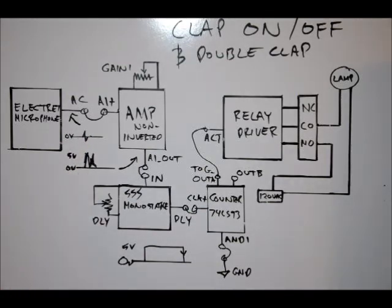However, when we clap, we get a frequency — on, off, on, off repeatedly — and we only want one pulse. You get a big whack of messiness; it's five volts but it's really a whole bunch of spikes, because every single tone has its own different frequency and it's amplified. So what we want to do is turn that into one clean pulse. We'll connect our A1 output to our LED to verify we've amplified it enough.